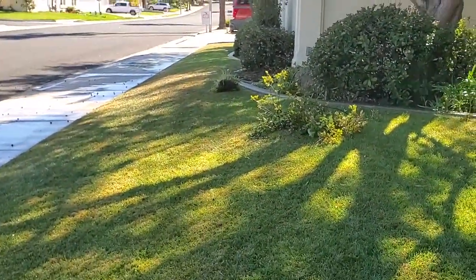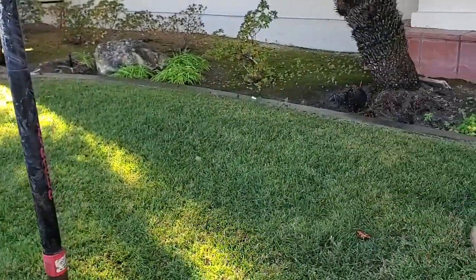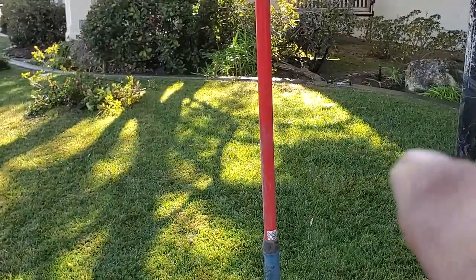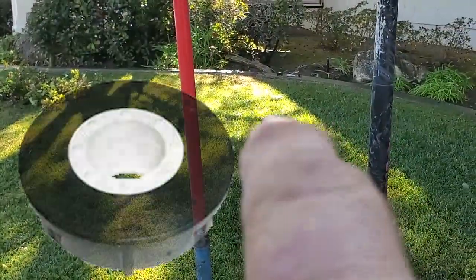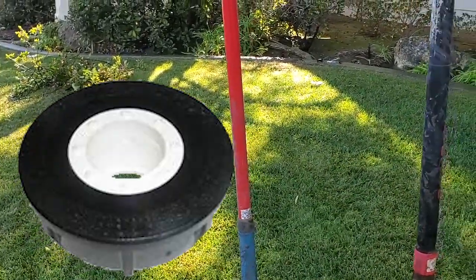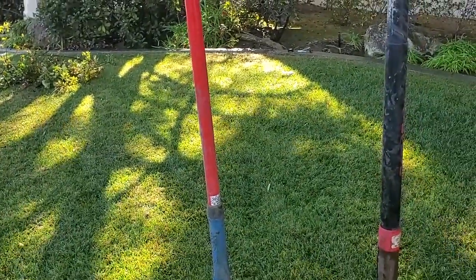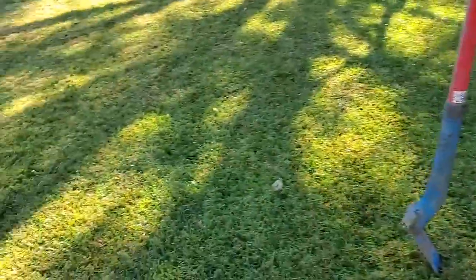So on this lawn line, I've had about 6 or 7 nozzles to replace because they were clogged. And then there was that bonnet over there I had to replace because it was gurgling around the seal on that Rainbird pop-up. On those Rainbird pop-ups, you can buy those bonnets by themselves. I keep a bag of them on my truck all the time.